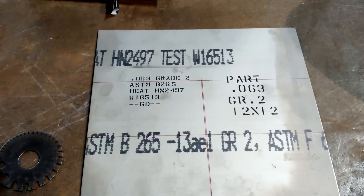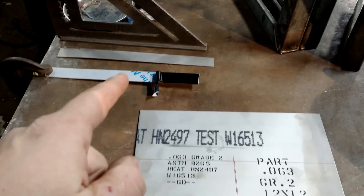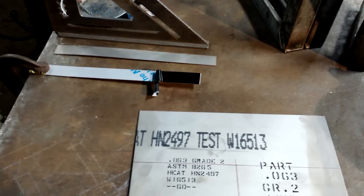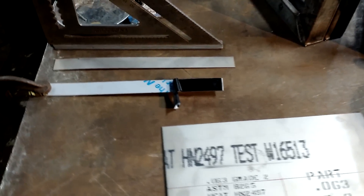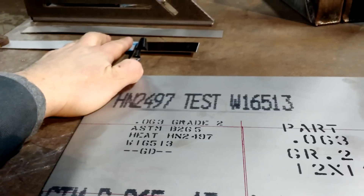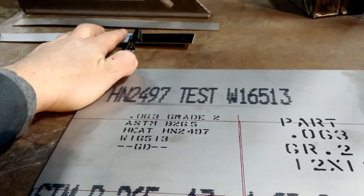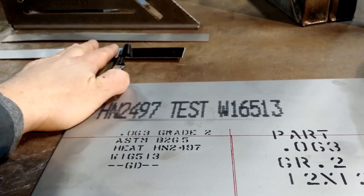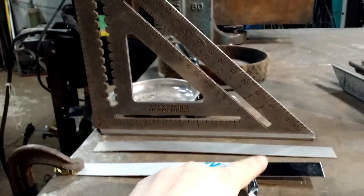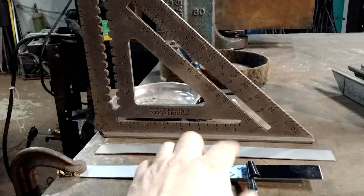On Sanction Fabrication here. I got a neat little test I'm going to do. I have a personal project where I need to cut a couple of one-inch strips out of titanium. I chose titanium because it has a natural spring-ness or spring temper to it that doesn't require heat treating. My natural choice would always be stainless steel just because it's rust resistant and pretty much always tough stuff. But titanium's tougher. How much tougher and how much better spring am I going to get? So I'm going to attempt to bend this thing and you're going to see the difference in degrees. Check it out.